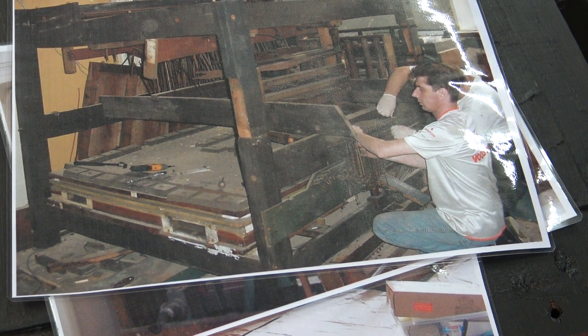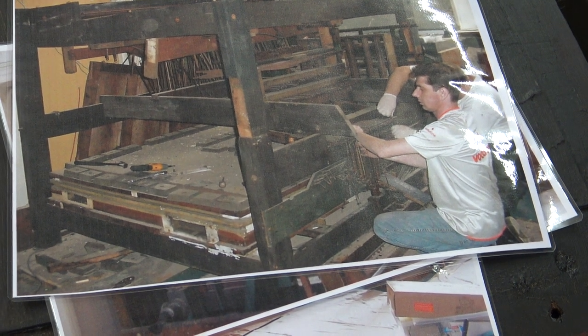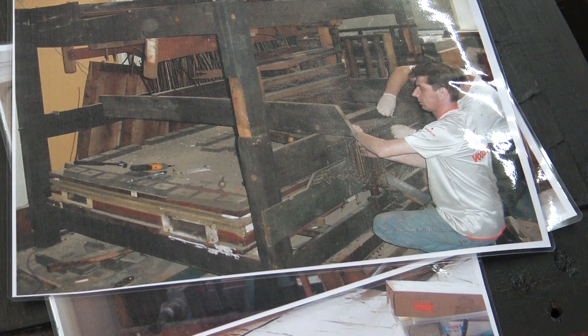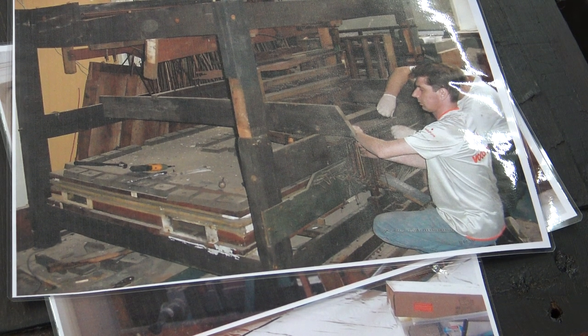And so we're going to paint this bottom of the bellows again. And then when time permits, perhaps next week, there's no grass growing around this. Remember, the building's still being erected. We're going to turn it the other way around. We're going to strip the leather off and we're going to start doing that re-leathering, which will be somewhere around £680 in leather, plus a lot of time. And it's applied with animal glue so that it can be steamed off in the future. You should get at least 75 years life out of a bellows leather. And this could have been patched, but we're not doing that.